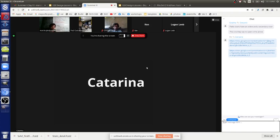Right. To be honest, aesthetically, I prefer them without the kick. In our house, they were originally built without it, and it looks really pretty because the light from overhead projects shadows down below the stairs. But in the case of Rosebud, it's a small house, and we want to make the understairs usable. Without the kick, you'd see all the mess inside the closet below the stairs. And what we found is that as you walk up the stairs, you just kick dust down, so whatever is below becomes unusable. But I agree, they look really beautiful without it. It's not required, as far as I know. I've never seen that it was required. Okay, cool, thank you.